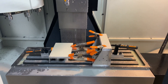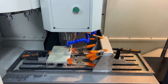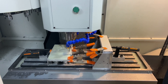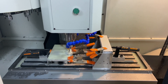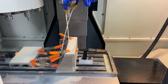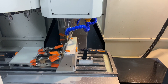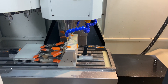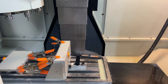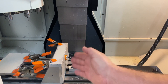This is my little 4mm tap now — you can see I've got a little bit of swarf on there, I'll fix that. We'll drop in with a 4mm tap. M4 has a pitch of 0.7, so I used a 3mm end mill to do a boring cycle and bring that hole out to 3.3mm. We're dropping back in now and this will be the end of the cycle. Not bad — 3 minutes 20, roughly, to do both those parts. Every time I open the door I've got a completed part I can bring out.